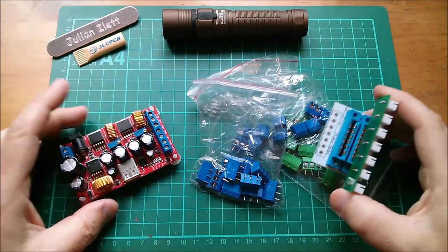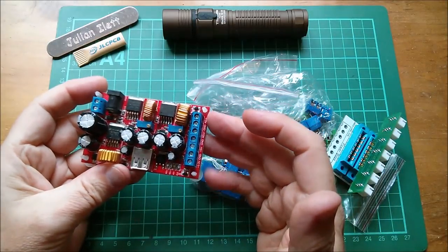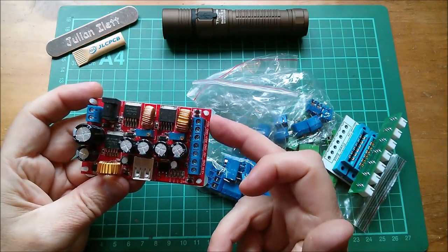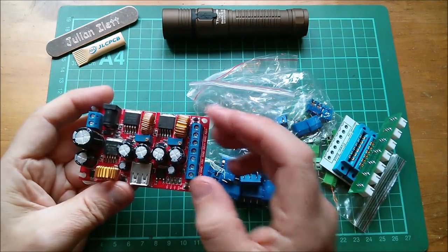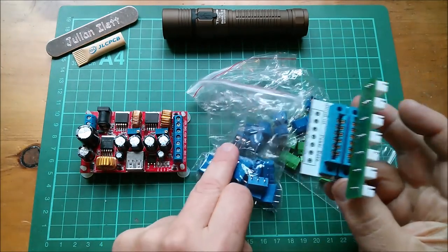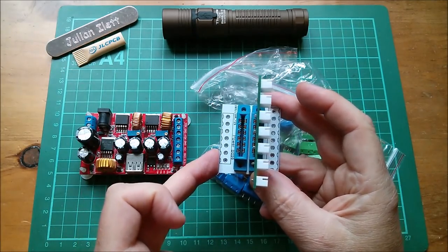So, why the colours? Well, this power supply, which is 12 volts in to a whole range of voltages out, a positive adjustable and negative adjustable, 5 volts and 3.3, I think. Well, I'm going to use plus 12, minus 12, plus 5. This power supply has blue connectors and seven outputs. So I designed this with seven outputs, but I'm going to fit blue connectors here so that I immediately know by the color coding that this power supply interface is on this side.